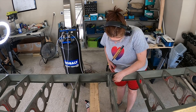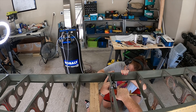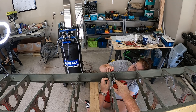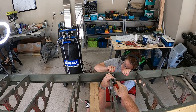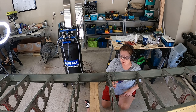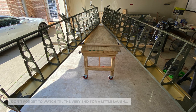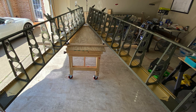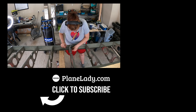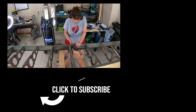It was a little funny because the very last part of step four actually says to rivet that bracket assembly last to improve access to the rib for riveting — so the rib was easier, but those three rivets in that one tight spot were still a challenge. Once everything was riveted together, it was really cool to have these rigid wings sitting in the garage and feel how sturdy they are. Thanks for watching — if you enjoyed this video please give it a thumbs up and subscribe for more videos as we build our RV-10.